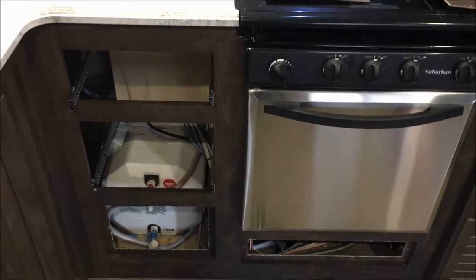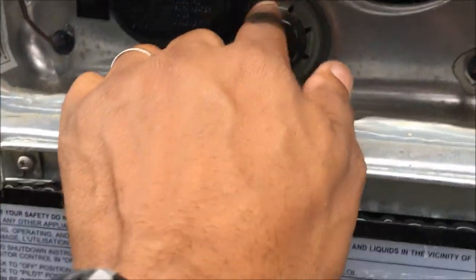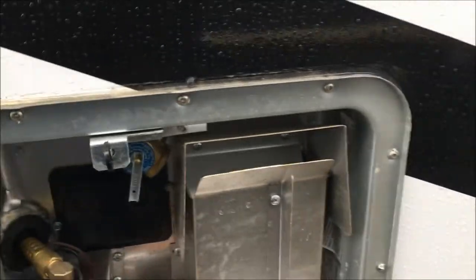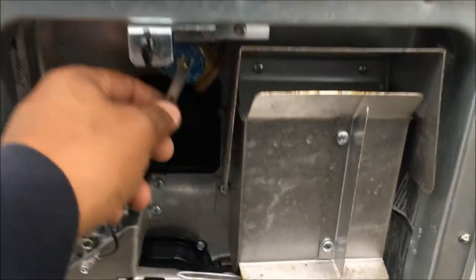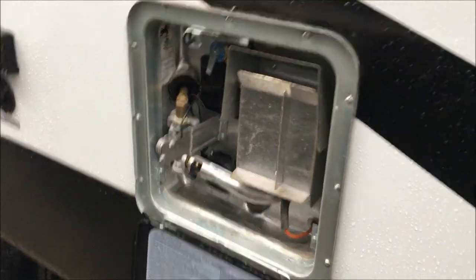The first thing I'm going to do is drain out the water that's in the hot water tank. This is your drain plug here. One important thing — make sure you take the pressure off the tank first, because if not, when you start unscrewing this with pressure on there, this thing is going to shoot right out. So you want to de-pressurize the tank using the pressure release valve. So a lot of the pressure is off of it. I'm going to need a socket and a wrench to get that out.